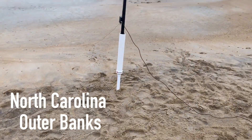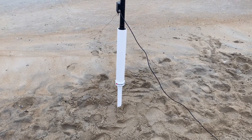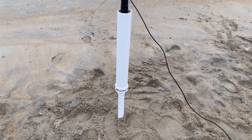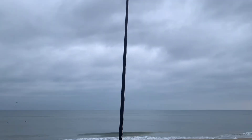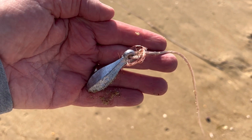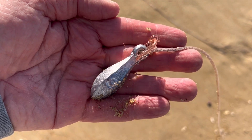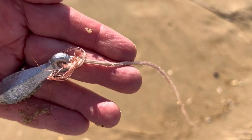I had some great success with the random wire but it did require the internal ATU of my radio. I used a 29 foot vertical length on the wire — a random wire is really not random, you have to hit a non-resonant point to make it successful — and I used a 17 foot long single counterpoise. A tip: use a pool noodle cut to six or seven inches, split it, and wrap it around to secure the antenna inside the pipe. For counterpoise wires in the surf, tie a fishing weight at the end and expose the copper so it contacts the salt water.